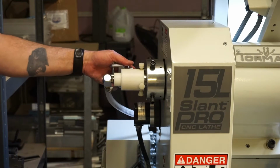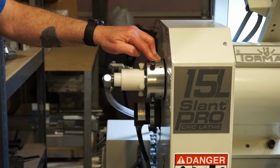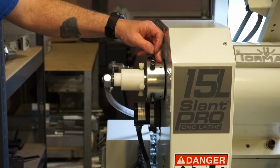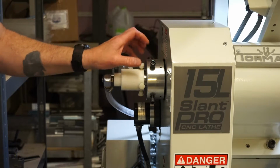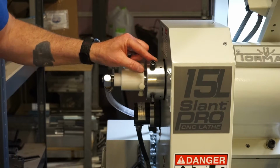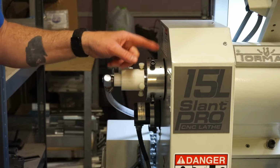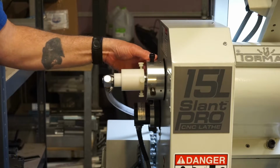Okay, now we moved over to the outboard side. I built the spider to slip over the collet closing indexing ring, which is right under here. And the idea behind that was to be able to remove the spider for doing production runs. That's a very tight fit on there. It's a little bit of an exercise to get it off. It's held down by 4 small metric screws on the indexing ring itself. And we got a standard 4-point system back here with brass tip screws as well.